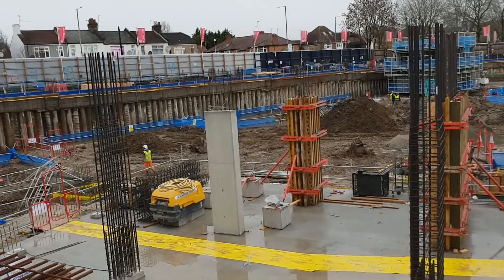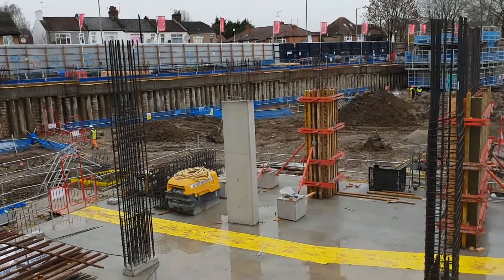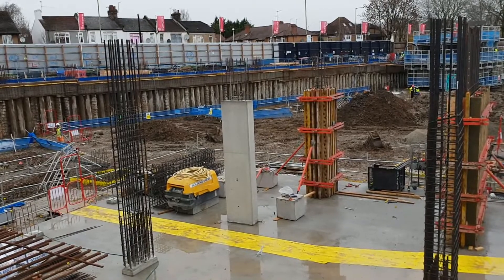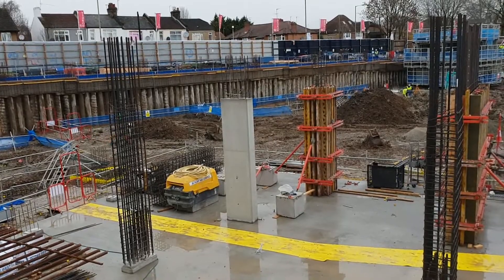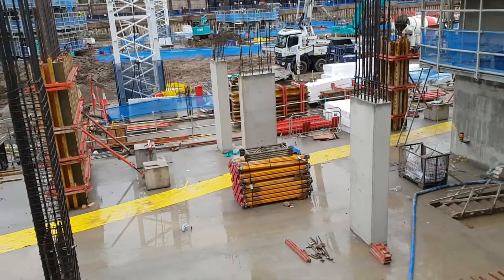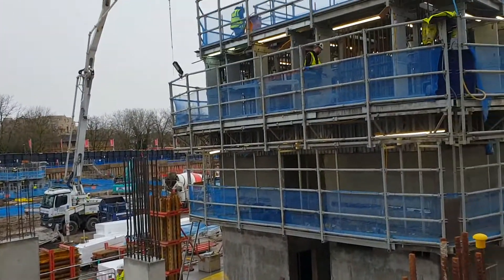The height of the column is obviously determined by the ground floor slab soffit. Normally what you want to do is pour this column around 20mm above the soffit of the slab, which makes it easier and better looking later when you're decking for the ground floor slab — which I'll try to show you from below. A few more columns here, and as you can see the legs and Perry props are already here to start the decking and the slipform going up.